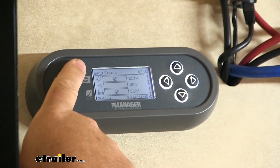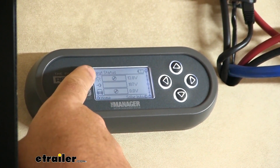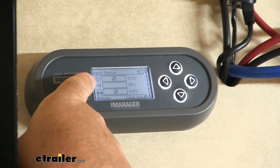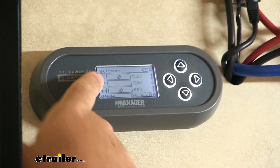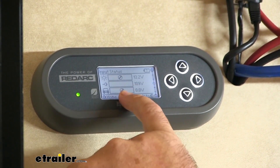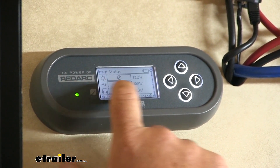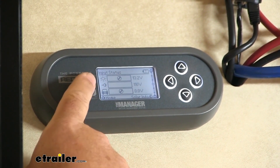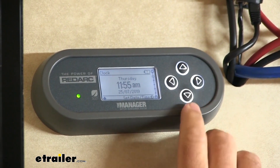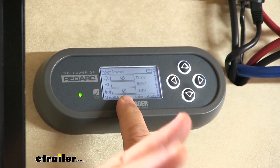These three here are your input status. The top one, you can see the sun — this is telling you your solar power, how much solar power is being brought in. This is when you're plugged into your 110 volt. You'll notice the two that we're not using right now have a little circle with a line through them, showing that those two are not hooked up. The 110 is showing that it's open, but that's what we're using. Once we hook up to one or the other — hook up to our vehicle — it's going to do the same thing and remove the circle. It's only going to use two of them at one time, so obviously if you're driving, the 110 is not going to be hooked up.